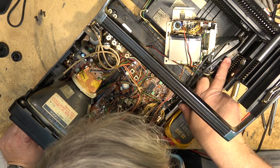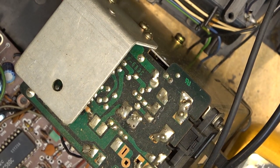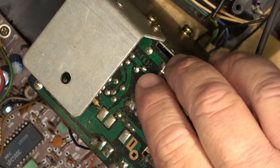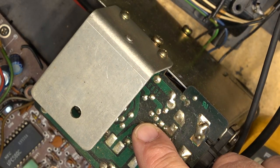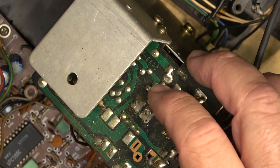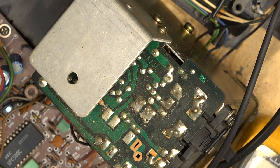These are the connections here — two AC pins going in, and these are the switch connections going past the DC. Some of these connections in here look pretty flaky. I'm just going to re-solder a couple of these connections and then try it again to see whether it turns on. Just waiting for my soldering iron to warm up.